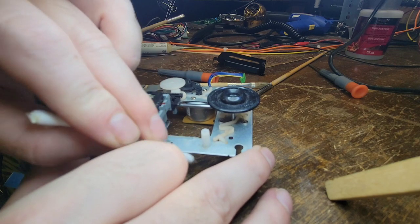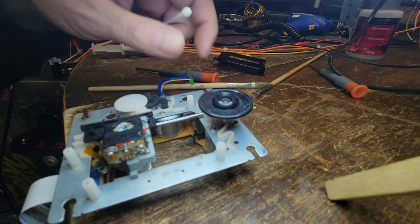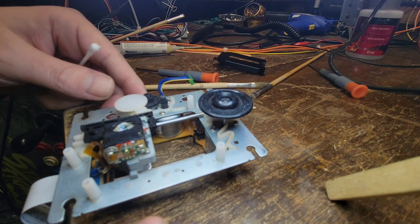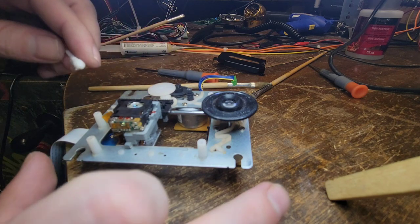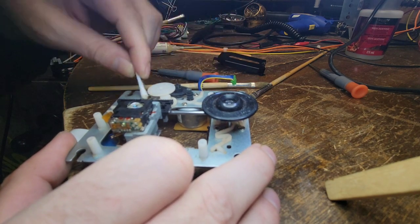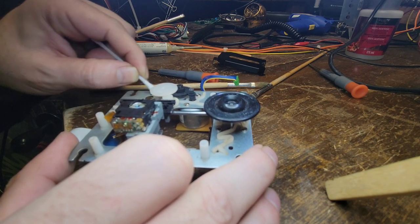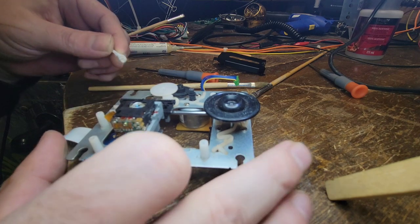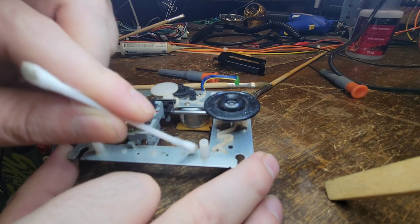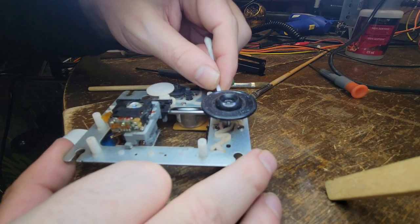Yeah, replacing the laser on this is super, super simple. You literally just bend that up, slide that rail right out the front, put a new laser on, away you go. According to the interwebs, apparently you can still find parts for these from JVC. I don't quite know if that's the truth, but I've seen that in more than one spot.